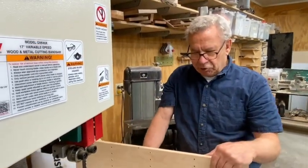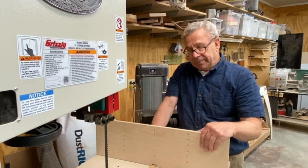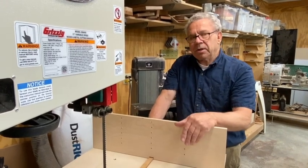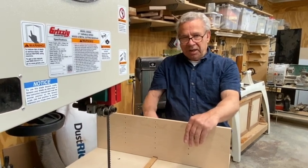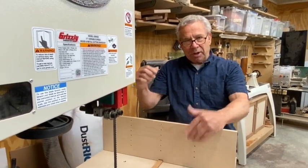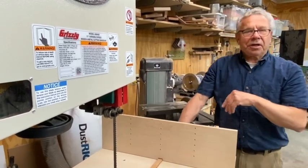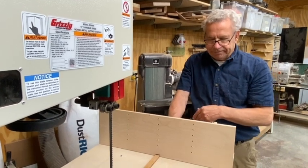I'm not really sure about the science behind gullet clearing, but it cuts much better than other blades I've used, and I've tried half inch and 3/4 inch resaw blades. It also has an invisible weld joint, which is pretty impressive. You can't see it anywhere on the blade, so there is no little hiccup each time the blade passes through that weld. So far so good. They are guaranteed against breakage, by the way, but not against pinching and binding if you're running it incorrectly.